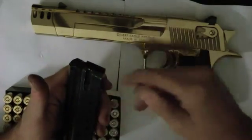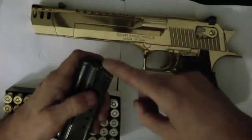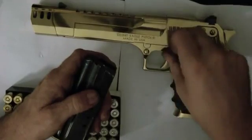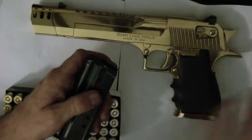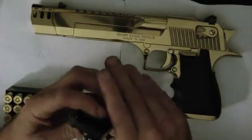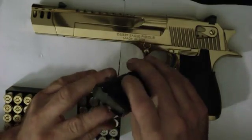Put them in there, run them through there. Also see how stiff it ejects. If it's ejecting stiff too, that means it's probably hitting the bullets there. You may have to grind some of that slide release metal off. I'm not saying to do a lot. Do a little Dremel, then sand it, and keep checking it. You know, make sure it fits, because it doesn't really need that much to be on there. Just a little lip, and that's more than enough.